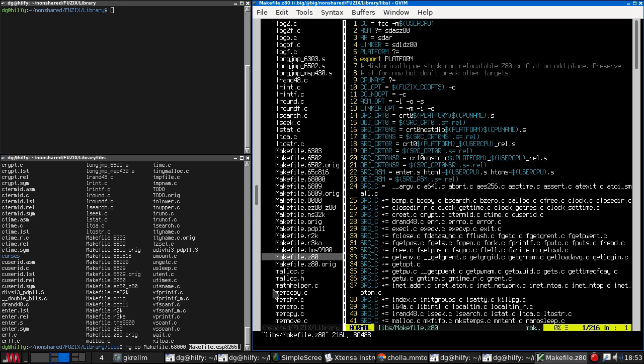Because the ESP8266 has no memory manager, we have to bake in the addresses where the executables are going to be loaded into the libc. So our libc is specific to the ESP8266 rather than just being a generic LX106 executable. In fact, that is not entirely true, that it is possible to generate relocatable executables, but I'm not going to because that's work.